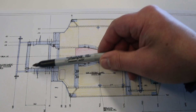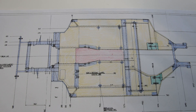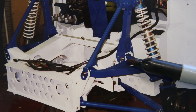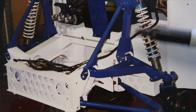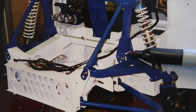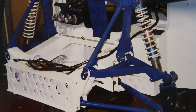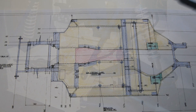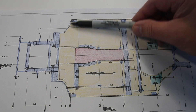At the front you have two chassis legs that pick up the front suspension points and wishbones. There's a frame out the front that carries the bodywork, the water radiator, and an oil cooler for the gearbox. Here is the front chassis with the wishbones on — the upper wishbone picks up at two points, the lower wishbone at two points. The shocker frame comes up from the suspension point, the dampers are spanned between the end of the upper wishbone and the shocker frame. The A pillars go from there around to here and include that triangular structure.